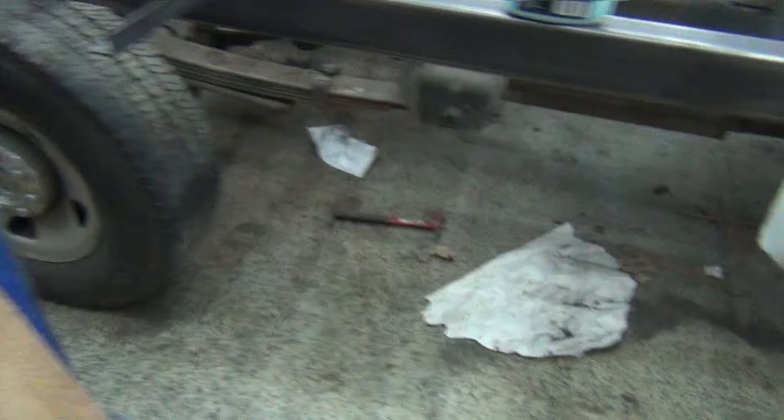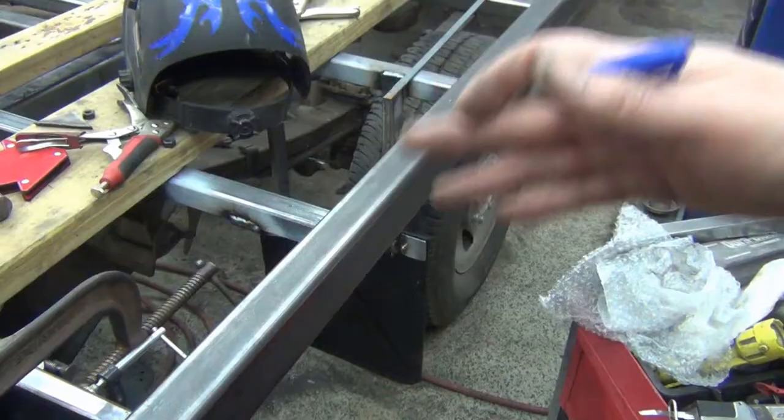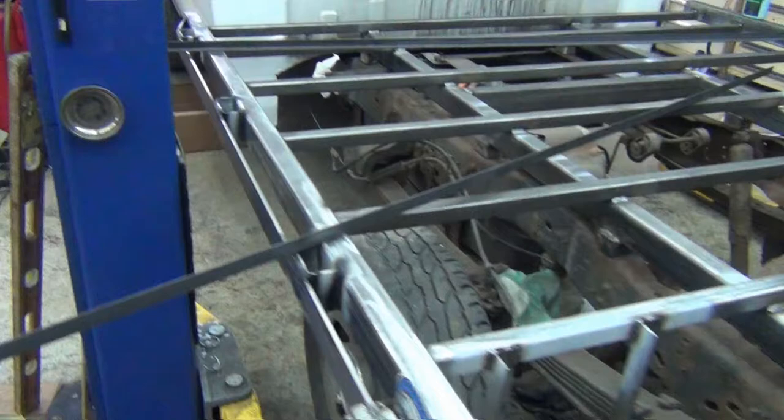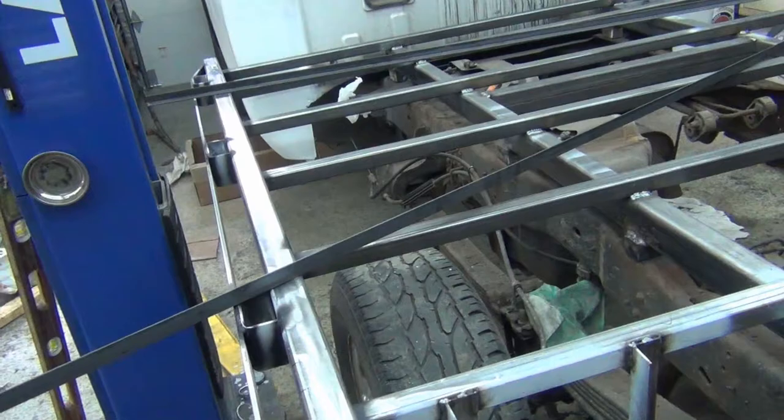And on the other side, I'm going to bring those stake pockets in about 10 inches. I'm going to start at about 10 inches from the end on each end and then space the two in the middle so that there's four evenly. And that's going to end up looking like this because this side is done. So we'll get started on that and then we'll come back